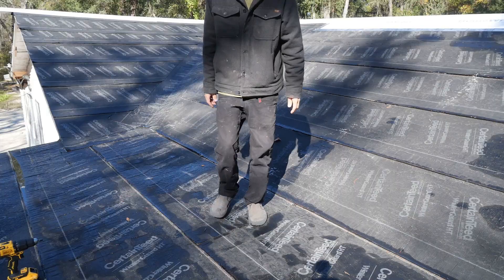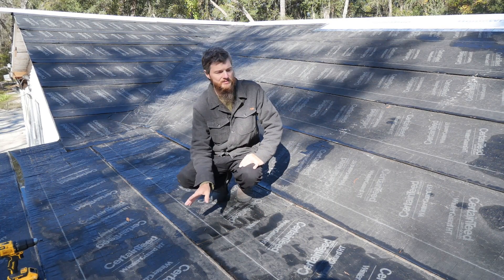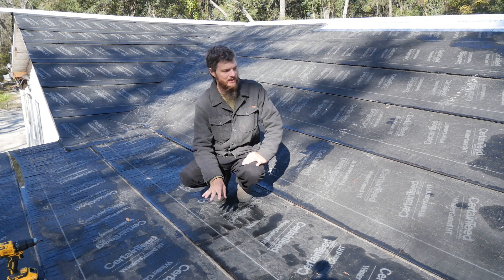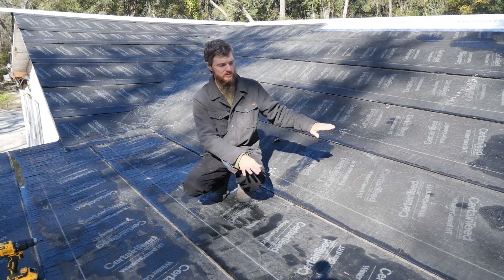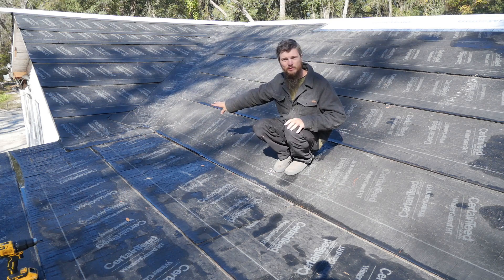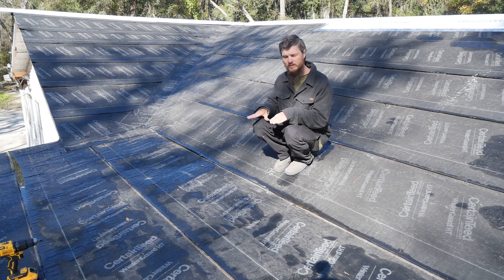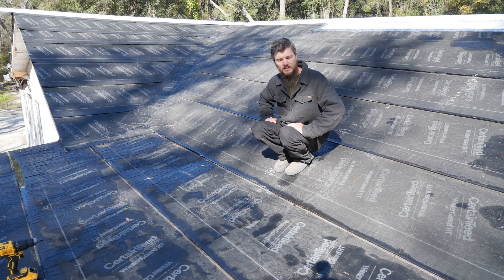The final one is the hardest. Right here is the porch — nice and flat, 1 and 12 pitch, very low slope. This part's not so bad. We have a 5 and 12 pitch right here so we're going to have to do a transition, but we also have a valley coming down from that roof and they all intersect onto this porch, so we've got a weird thing here.